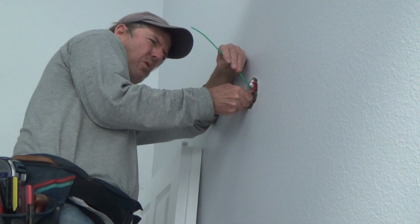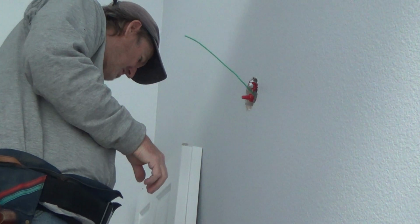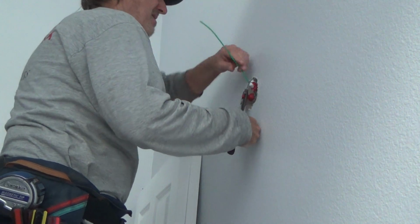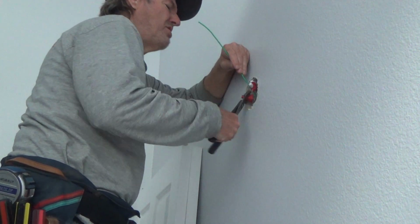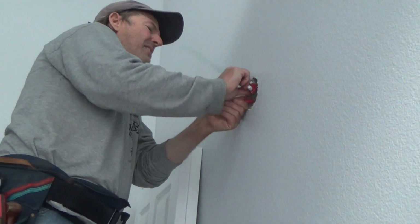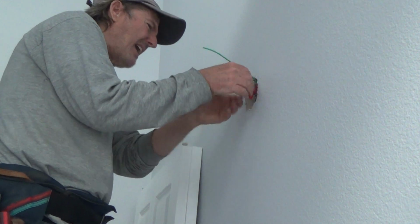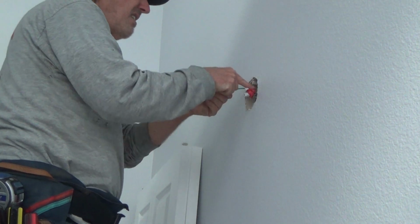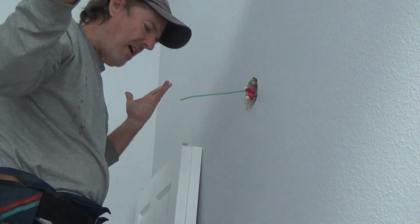And these red wire nuts have wings on it, so I can take my thumb and my finger and tighten that down. And because I'm having a hard time with that, because it's so tight and close to the box, I'm just going to take my pliers and give it a couple twizzles. And they frown upon doing it this way. On most of your applications, you shouldn't have to do this, but I'm doing it because I can, and because it's right up there tight. Now I'm feeling on there, everything's fine, and now I can push that red wire nut back into the back side of the box, trying to get other things out of the way, get my fingers off of the wall, okay, and I can redirect my ground wire coming out of the middle, okay. So I've got my ground wire just like that.